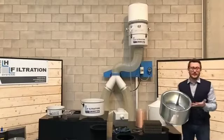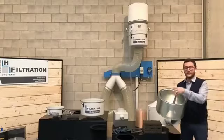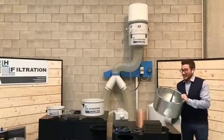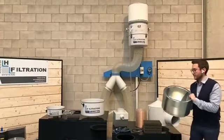it goes randomly, okay? So you can have some panels where you have more oil, some parts where you have less oil, so obviously the drum can be unbalanced. And this could be the reason. This is the most frequent reason where you have an unbalanced drum.